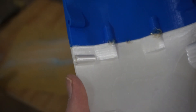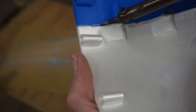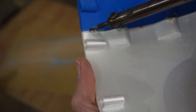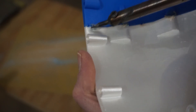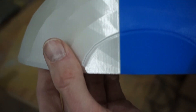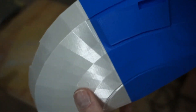To avoid a huge divot, I drag the soldering iron along the seam and fold both edges in on themselves — folding one side over and then the other, back and forth, to get a mixture of plastic from both sides. I almost think of it as actual welding: I do small circles to get everything mixed and stirred together, then let it cool down and it becomes one fused, really nice part. It's so strong once fused.